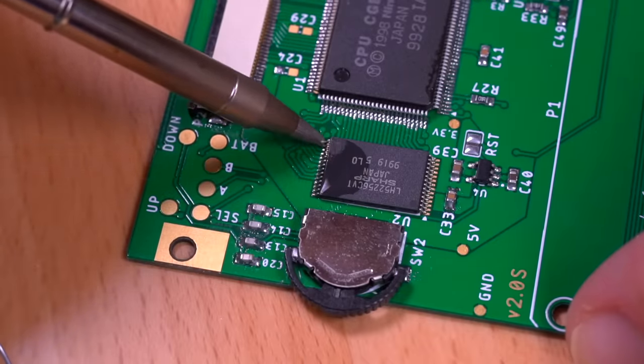Now, while my particular build utilizes two AAA batteries for powering the console, BucketMouse also incorporated the ability to use rechargeable lithium-ion batteries that does provide longer battery life. This was still being worked on during the filming of this video, but should be ready and published on his GitHub soon. Also, he integrated this rocker switch, which now controls the two touch sensors we removed from the IPS kit driver board, which is the brightness by switching up, as well as changing the color palette by switching down.